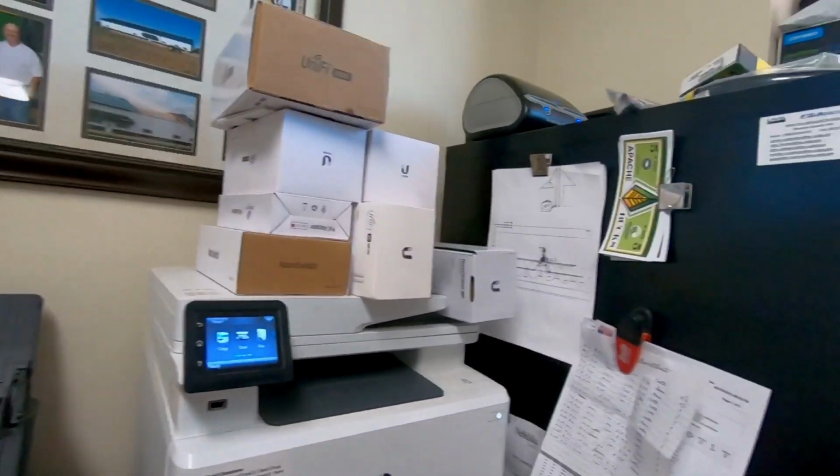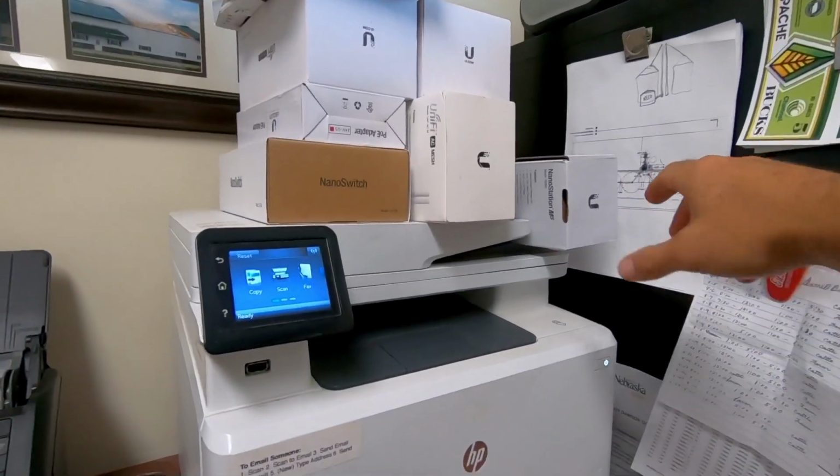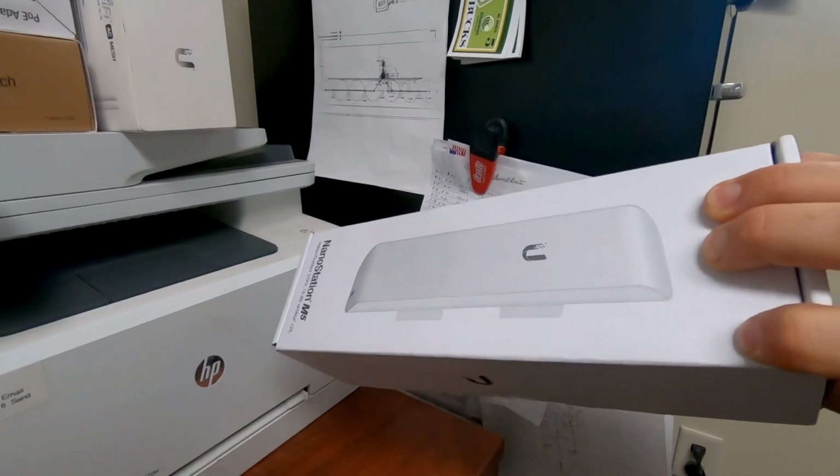Another thing while I'm waiting, on our bin site, we have to be able to shoot internet access over there, so it's able to monitor the grain dryer remotely, and also we'll probably put some kind of bin monitoring systems on it. It's kind of too far to obviously run lines or anything, so what I use a lot of is Ubiquiti's products here. Kind of got a stack of stuff. With one of these guys here, it'll be able to make a wireless bridge over to the bins, and hook that up to a repeater, or basically another wireless point, and have Wi-Fi basically over at the bin site.